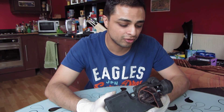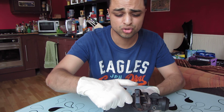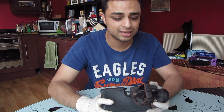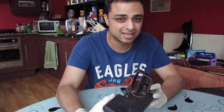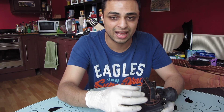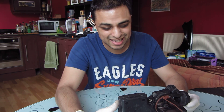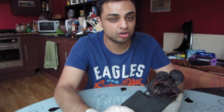If you've seen videos online of people taking apart the DISA from the back and removing this end piece, it's pretty brutal taking it off, and although the unit might function correctly afterwards, I would question how long specifically this flap section would last. Once you've taken the DISA out, it's not that difficult to remove it periodically — maybe once a year — just to check on the condition of the flap. I'm going to do a bit more research and decide whether it's worth replacing some of the parts, or I'll just check on it periodically every year, and as the vacuum pump gets closer to failure, I'll probably just replace the DISA.